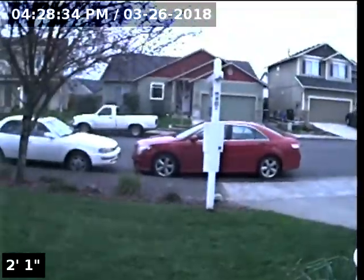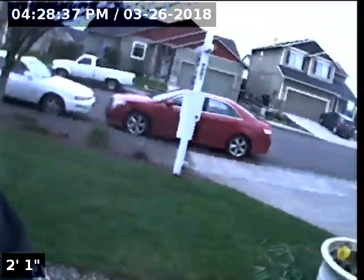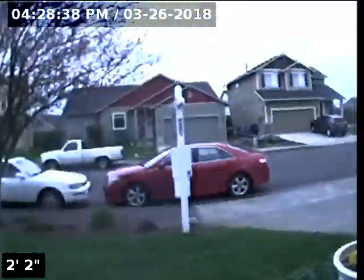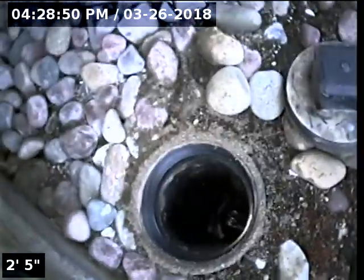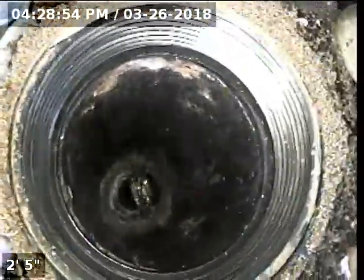The house is facing north — or at least I've oriented it north for our purposes here. There's a north street there, and I do identify some manholes out there, which tells me the city main is in that direction. I've located a three-inch ABS cleanout here on the side of the entry door on the north side. Notice how the water is running from the kitchen sink. The purpose of this inspection is to determine the overall condition and serviceability of the sewer lateral for this property to the city main.